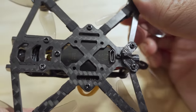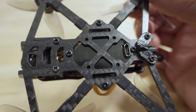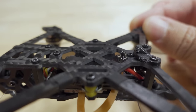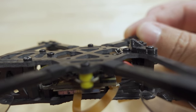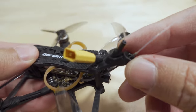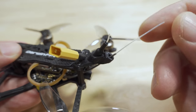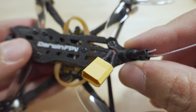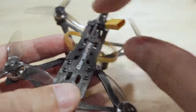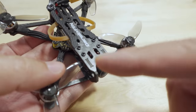The USB port comes out of the bottom of the board, and there's a little clear protection plate to protect the components on the bottom. There's a small 3D printed part mainly to protect the USB port in case you land on it, though the screw is actually higher than the USB port. In the back there are a couple of antennas — the VTX antenna and a longer one for ExpressLRS, held in with a little TPU part. I replaced the battery strap with a rubber band so I could run the batteries sideways, since there's not enough room to run them forward and backward.